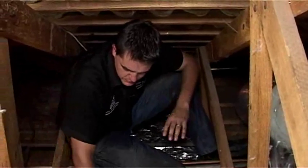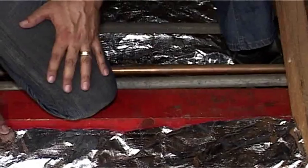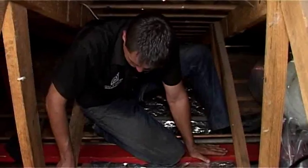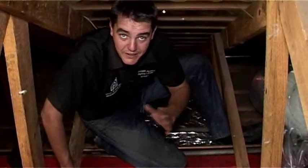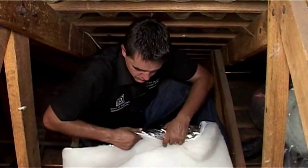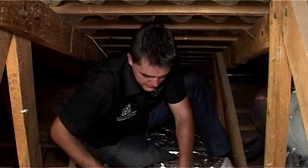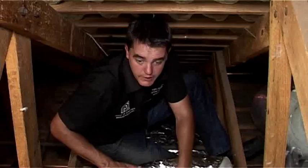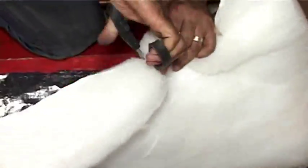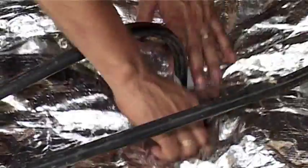We're now going to do the section on installing on an existing ceiling without insulation. What's also important is marking the roof rafters — we've painted them red so when you get out of the roof you can visually see if you've left one behind. In terms of installing, you never want to cover any pipework, because if there are leaks or plumbing work needed you want to be able to trace the pipework, especially with electrical wires. It's as simple as taking scissors, cutting the insulation open, and working it around the pipework. The insulation is best installed on the ceiling boards with the foil facing up, giving you that radiant barrier.